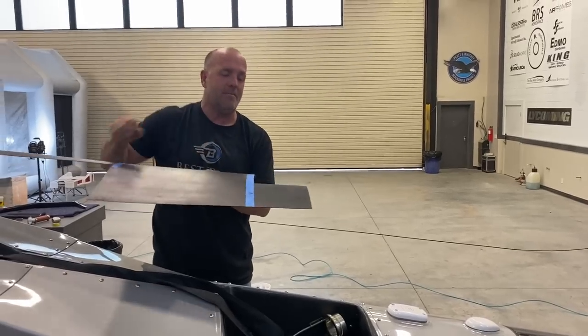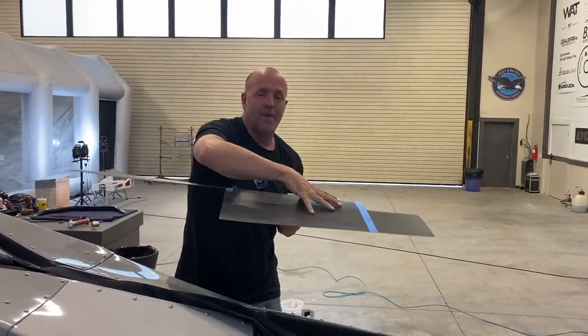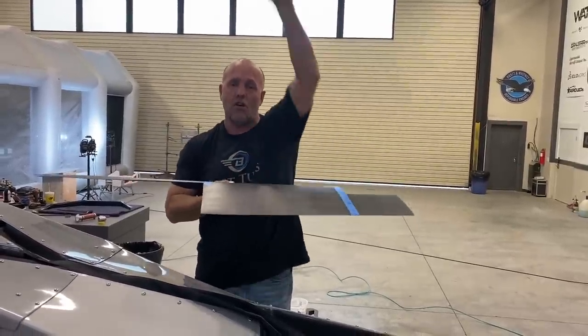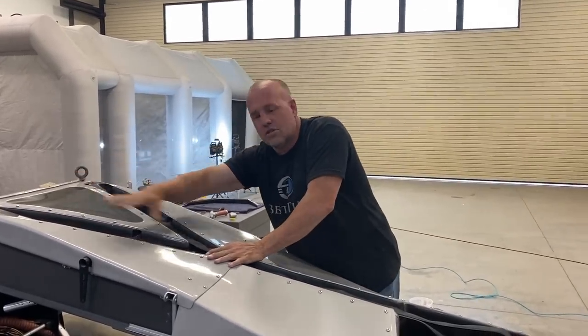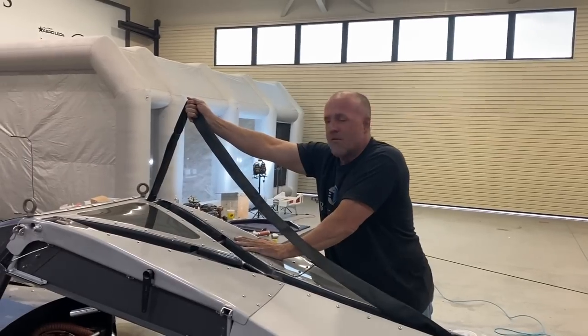The rocket gains momentum, then these cables will pull across, rip this section off, parting at this line. That's where the parachute goes all the way out. And there is a painted trim that goes the rest of the way up, and it would rip these out, that painted trim, and hang from right there.